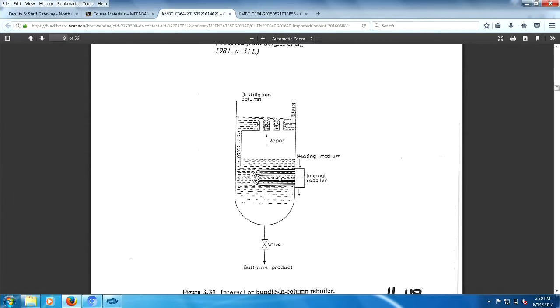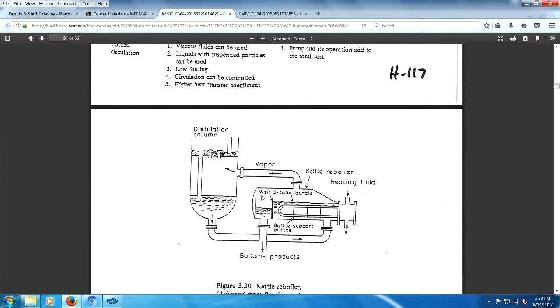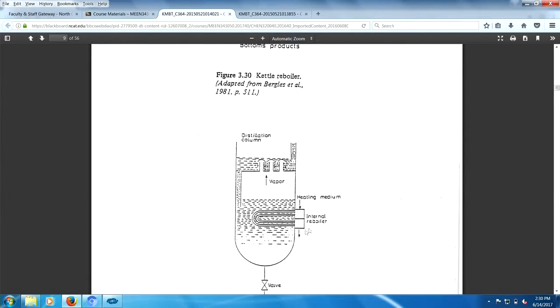So this is not such a great idea, necessarily. See, what can happen over here is I could possibly have a couple control valves to take this unit offline to clean it and then bring on another unit over here. And as a result, I don't shut down the distillation column. Over here, when I yank that unit, when I yank this out, the column has to come down.